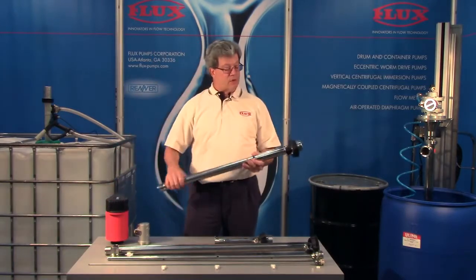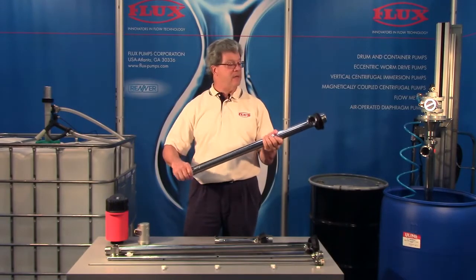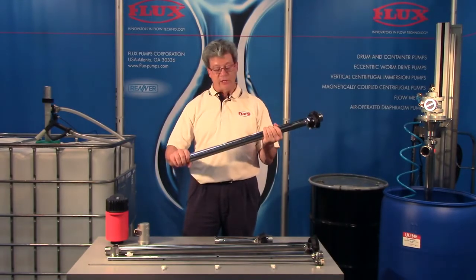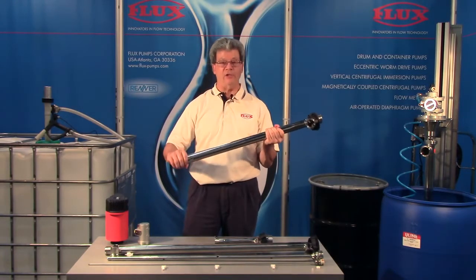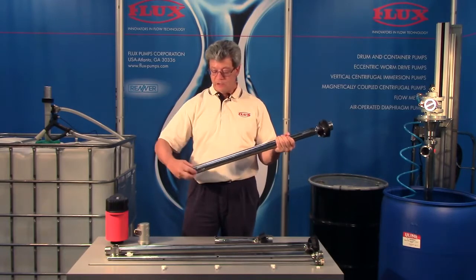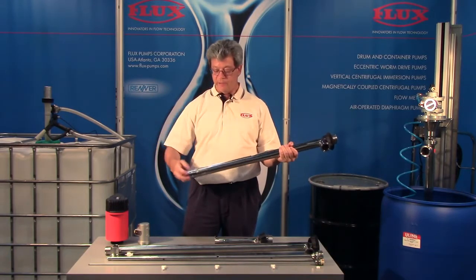All of these pumps come with an inch-and-a-half tri-clamp and are designed for quick tear-down. What's unique about this 3A pump is that it's electro-polished and then hand-polished to a 4RA surface finish. They are designed for a quick tear-down and I'll do a little bit of one here.